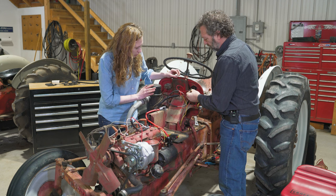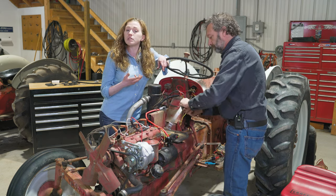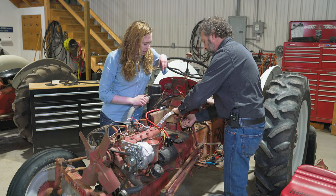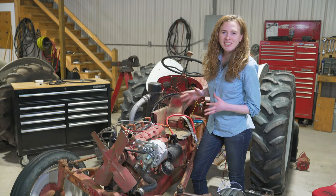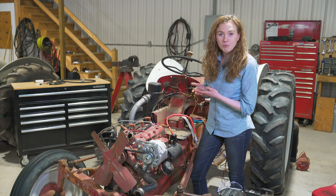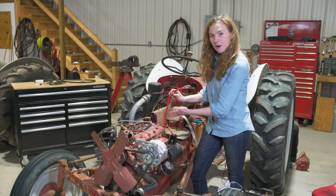We are putting a new braided-style ground battery cable on — braided is easily recognizable as ground, which is a safety feature. Let me give you a recap of the wiring: the battery cable brings power to the system and goes down to the solenoid, where it also connects with the red wire that traces all the way up to the positive side of the amp gauge.